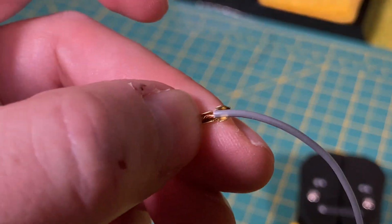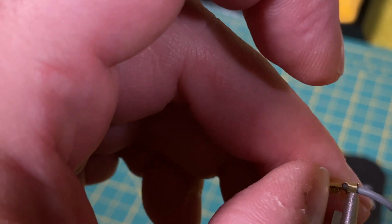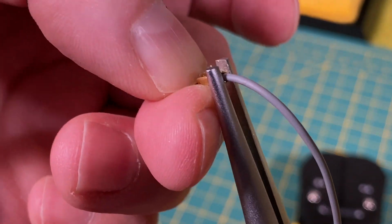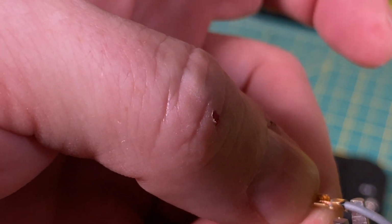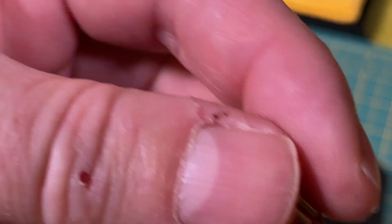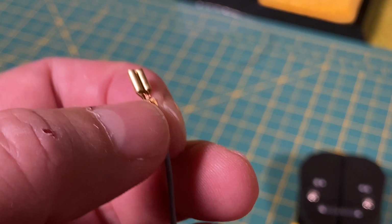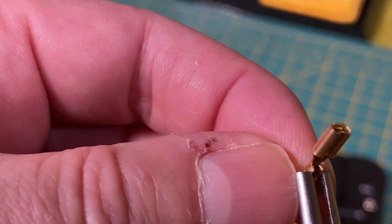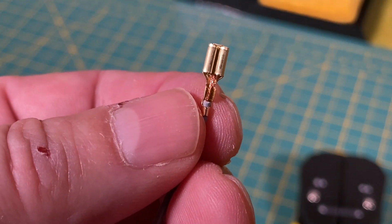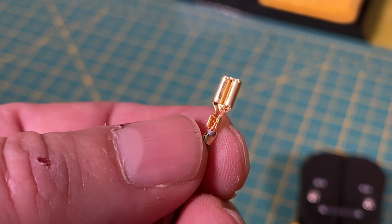your plier. So you see I have here the gray right there, and then I can basically squeeze this together around the wire, because when I do this, it will actually hold it to the wire. Okay, and then now I got two choices here. I can either just squeeze this one here like this. Okay, I can basically just squeeze it together here like this, or I can solder it in place. Now the best thing to do is actually to solder it in place, so I will do that.